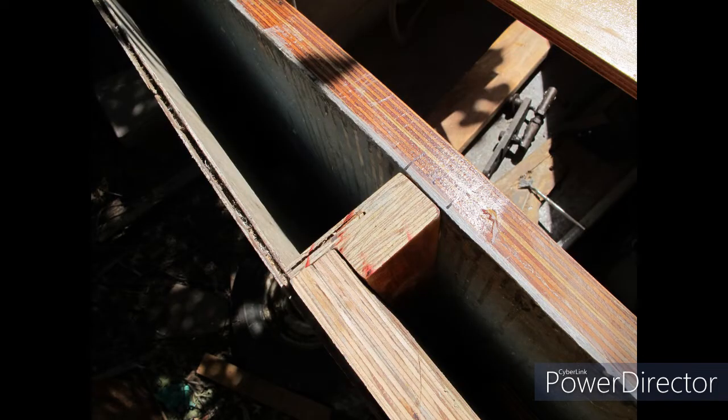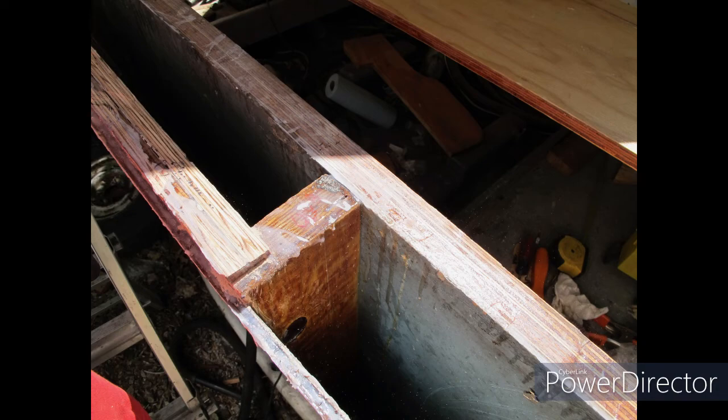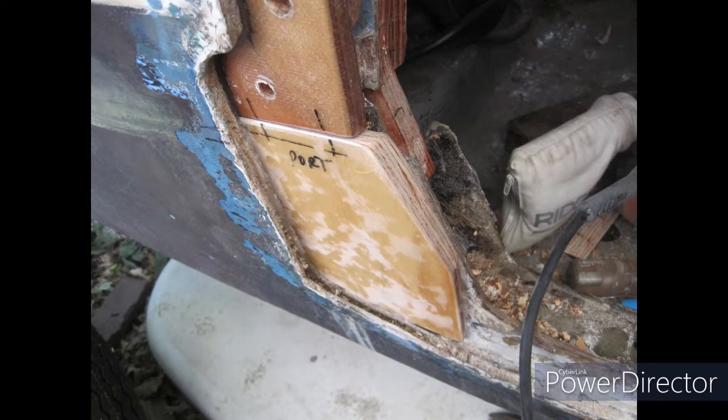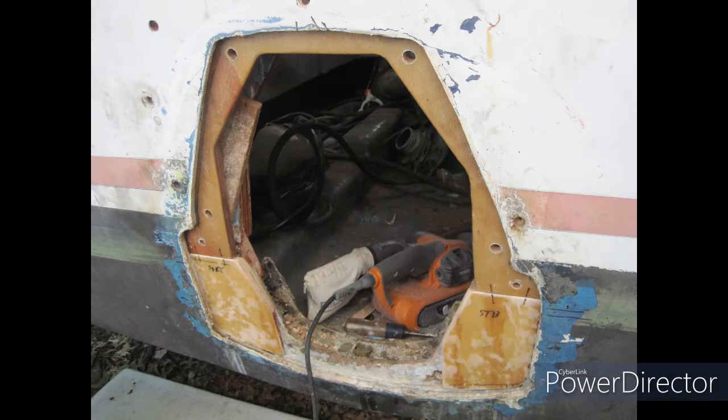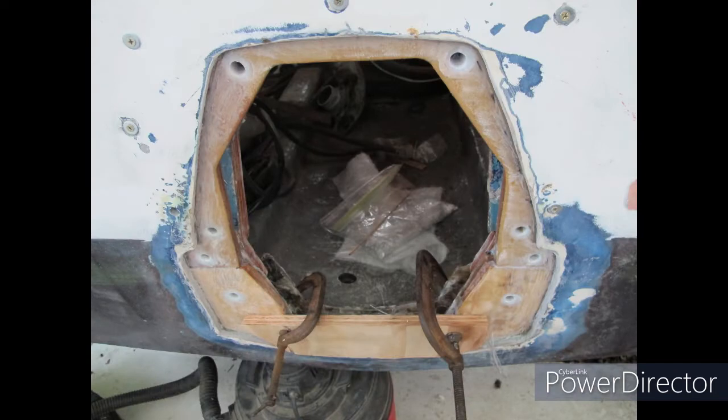That fits in there and replaced all that rotted wood that was in there, separating the transom from the false hull. That all got epoxied in with a few screws here and there acting as clamps. And then I had to actually start to rebuild the area for the transom plate. You can see where I mocked up — it's tapered because that's V-shaped coming down from the top of the transom to the bottom. It's all now starting to come together, and you can see I've reconstructed the entire area around the transom plate.